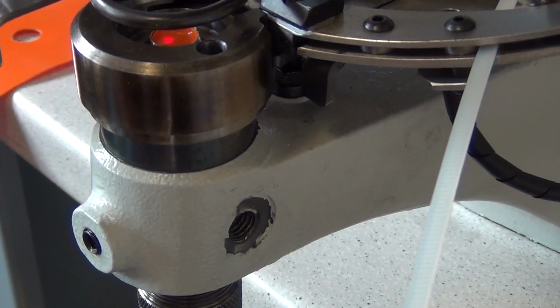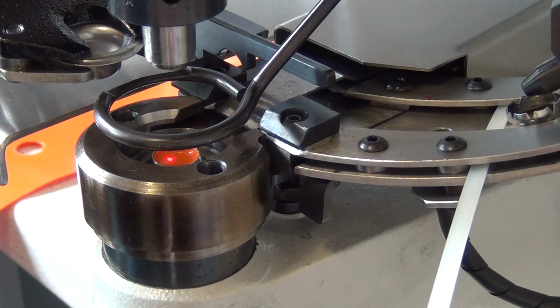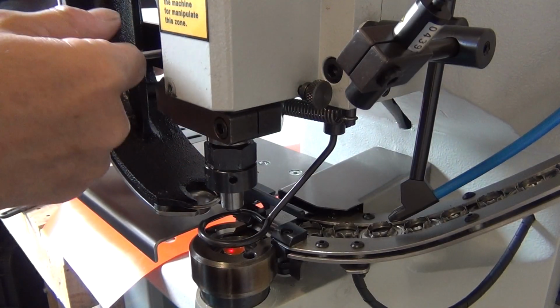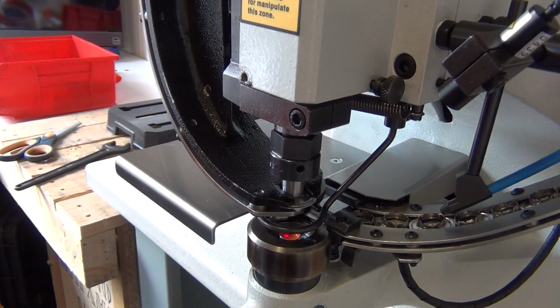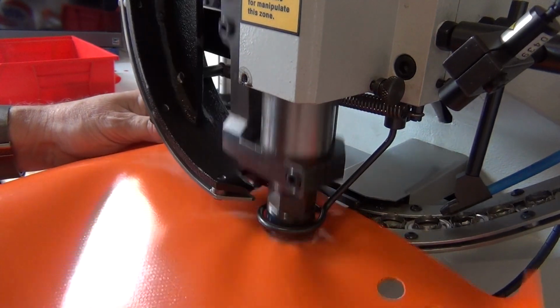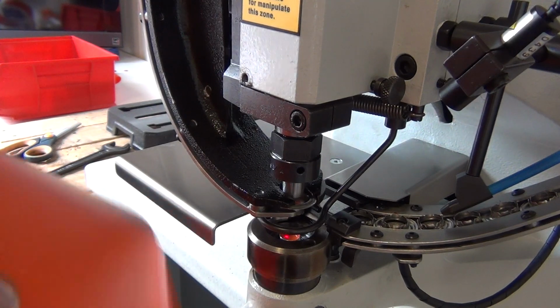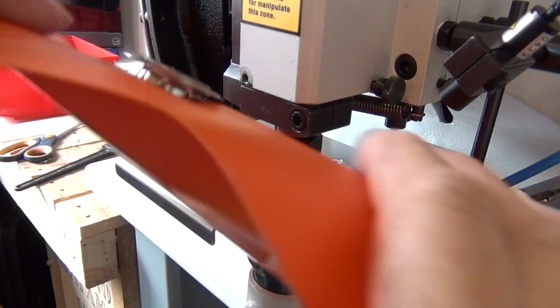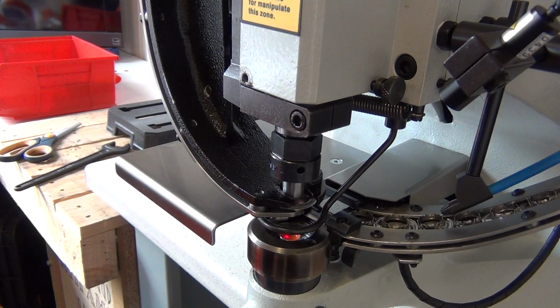The first step is to allow the eyelets and washers to feed again. Remove the wire tie on the washer side and remove the puncher holding the eyelet raceway. Do a test setting. At this point, the top die is in the position furthest away from the bottom die. This means your test setting will be barely closed. This could be what you desire if you have very thick material, or are maybe eyeleting corrugated material. More likely, you'll want to have your setting closed more tightly.